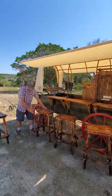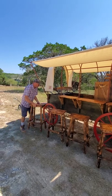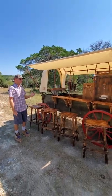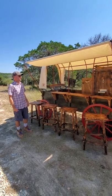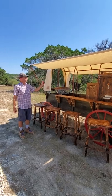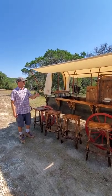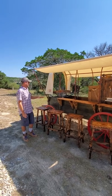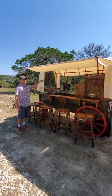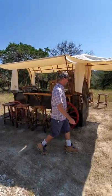Everything is sealed with three coats of Olympic penetrating sealer, and it's good for up to three years. But I think every two years, if you just get a little Hudson sprayer, you can mask off your refrigerator or your steel, your kegerator — we've shot the whole thing. Just spray it all down, including the sink counter and even the canopy. That'll just give it a longer life.